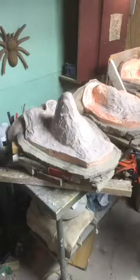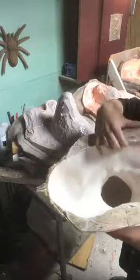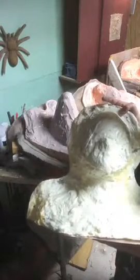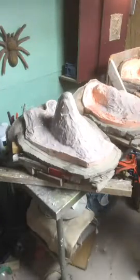Here, Becky found one in the closet. So this is an alternative to a fiberglass mold. It's a plastic mold. It's a good 1/2 inch thick. It's got a silicone in between. I think this one's actually an older one of ours that looks like Mold Max 30 that we've tinted. But it's got the silicone shell in it. This is from a life cast of a head. And then we use the 1512X as a plastic shell. So it's a bit lighter, but if I were to throw this on the ground, the odds of me cracking the plastic are much higher than if I do it in a fiberglass. So that's a plastic version, which is the alternative to this process we're doing here. Alright, so